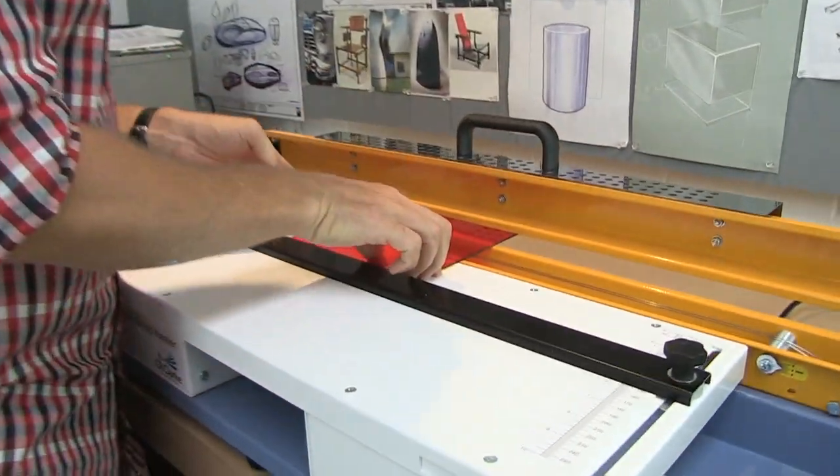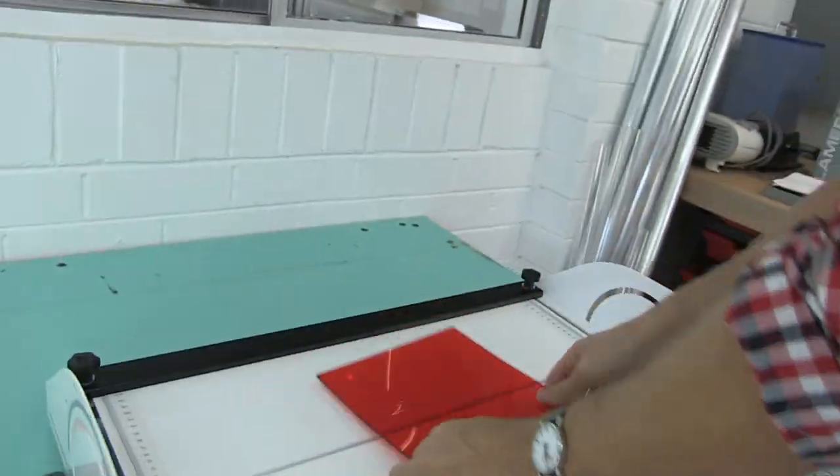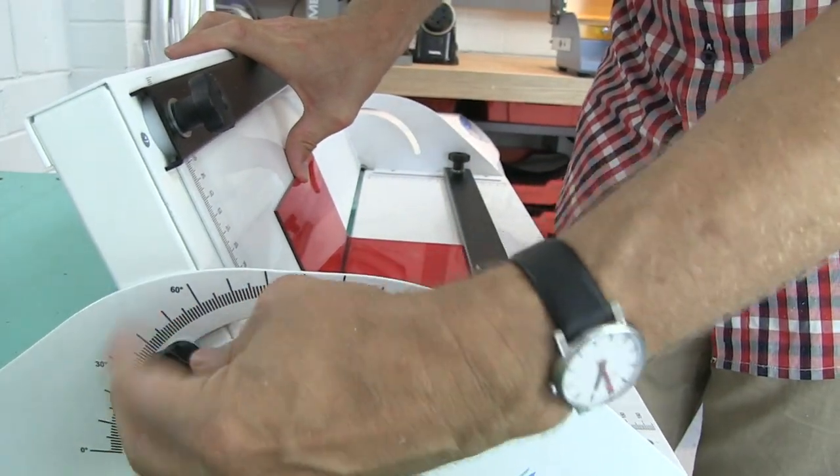Okay, so that's been about a minute. Take it out. We can fold that by hand, but let's use a folding jig to get an accurate angle. We can place that against the guide bar, lift it to the height we want, and even choose our own angle. And we just let that cool down, which will take 2 or 3 minutes.